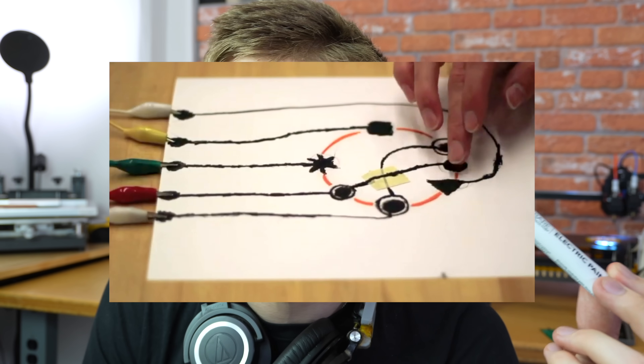This approach is different — not putting tape across the whole board, but stenciling or extruding this stuff onto just the pads and placing the part into the liquid to make the connection. There's also something called Electric Paint from Bare Conductive, available from Adafruit. It's way thicker and intended for making circuits — like capacitive touch keyboards with a Makey Makey. Because it's thicker I have higher hopes for it holding parts better. I'm gonna load both into syringes, extrude onto the FTP board pads, place parts, and see how it goes.